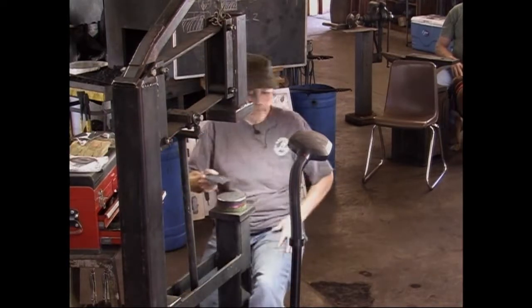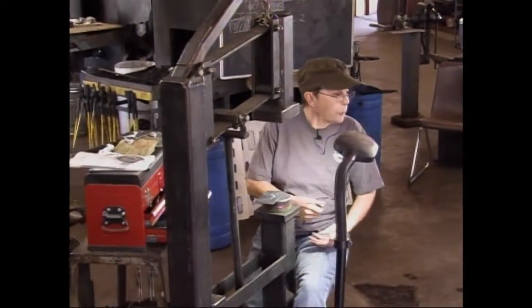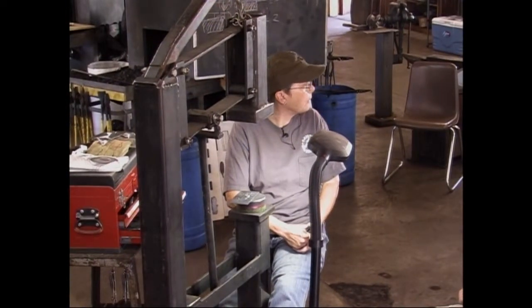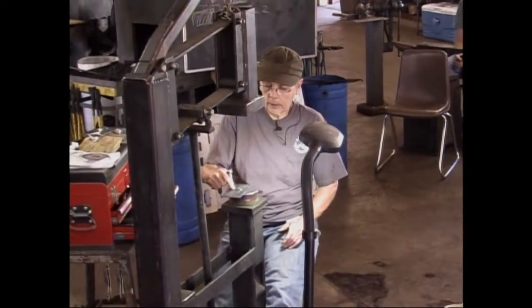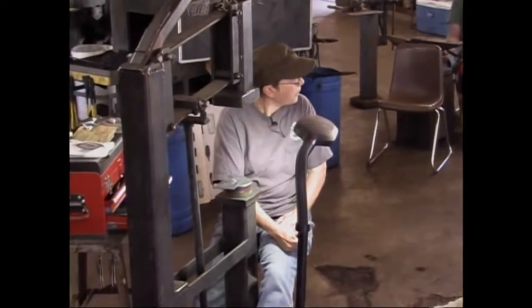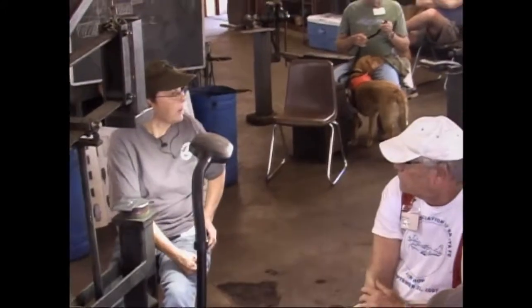We happen to have an aluminum plate. Would you not recommend flatting on the aluminum? If you have aluminum or copper, it's really nice to work with. It's really soft and really easy, and you wouldn't get discouraged as quickly. When I started doing it, I made some leaves, then I started working with copper some. Copper is slippery. Your tools will skate on it some. Steel, it's not as bad. But as far as learning how to do it and learning how to raise things, copper is excellent. Aluminum is good.